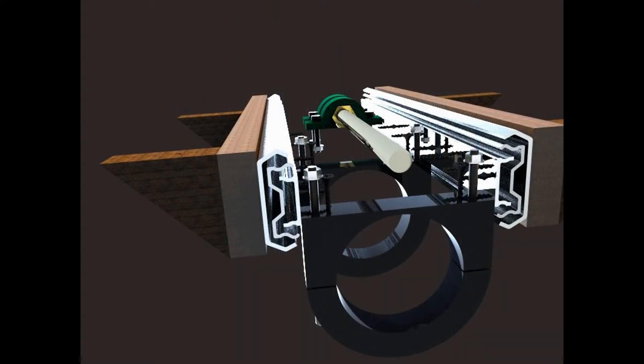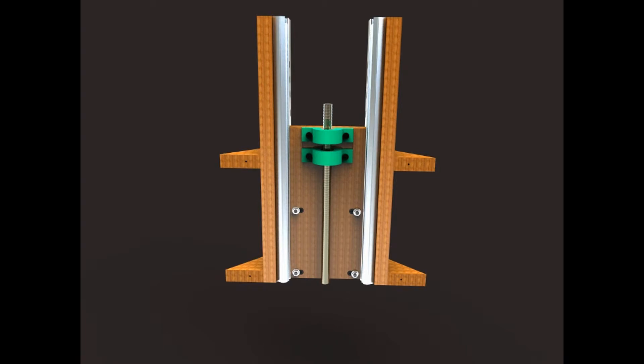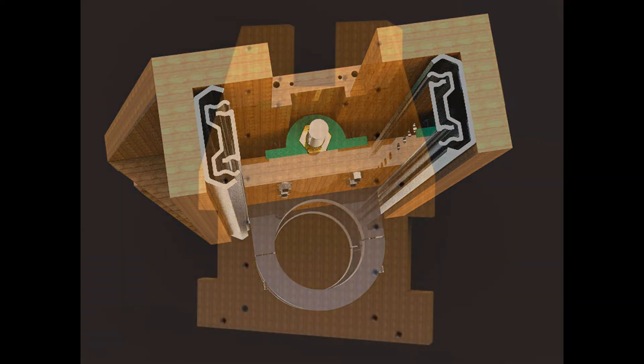I've removed the back panel so that you can see how the parts attach together, and here you can see it reinserted and back into position. Our next step is to attach the back to our actual uprights. Here you can see a top-down shot. What I want to show in this top-down shot is the actual groove that's been cut out to enable our anti-backlash to move up and down correctly. This needs to be of tight tolerances — enough material on our backer to keep it strong, but enough removed so that our z-axis will go up and down correctly.